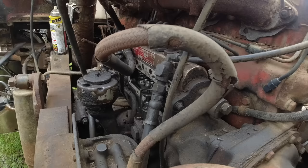Hey, we're out here at this mat, we're putting that pump on. Is that pump timed, or can we manipulate that output shaft or whatever? The issue we have is there's a spacer in there. It's got a dowel in it, right? And that dowel lines up with the hole on the motor side. Our hole is at like 3 o'clock, but the dowel is at like 2 o'clock. So either I have to turn the motor or turn the pump so the peg goes in the hole.